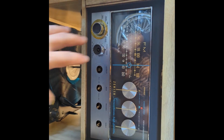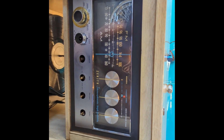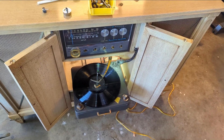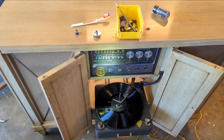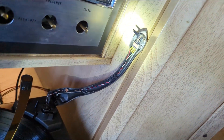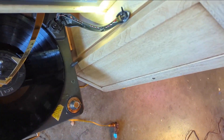There's still something causing issues. Back to the drawing board — we've got to take this out and look for more touching connections. This is a weird scenario where I cannot figure out what's causing this strange issue. At first it seemed like a tube issue because it only happened after warming up, but it only does it on record player, not on radio. So I'm wondering if the cartridge or needle is starting to go out. I actually have a spare cartridge and needle right here.